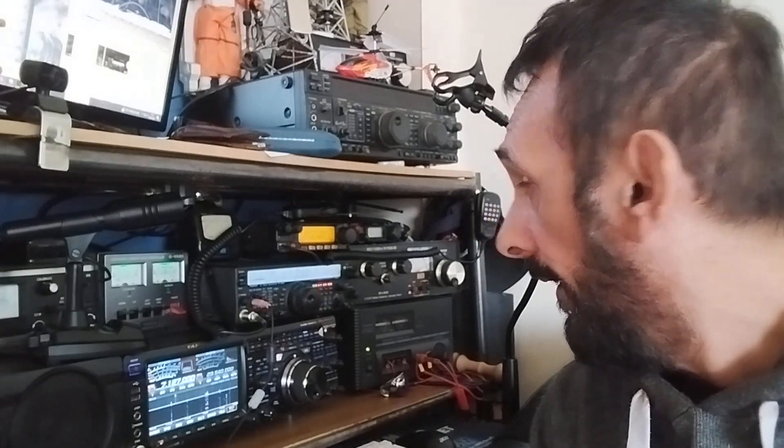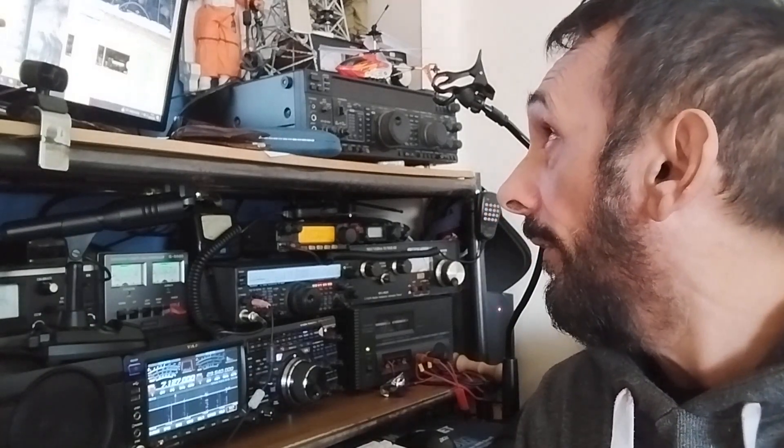Thanks for watching so far. Just waiting for the processing to happen on that image — it's delayed because I've got an immediate next pass coming up from NOAA-18. This one's operating on 137.915 MHz, starting slightly higher. It should come through quite nicely as it goes straight over, just north east of my location at a very high elevation. I'll then have two images to process.